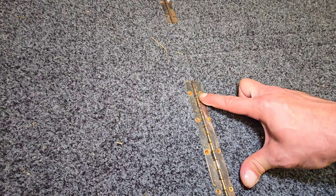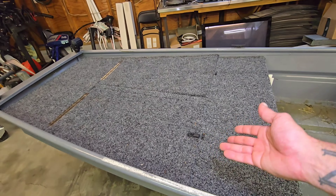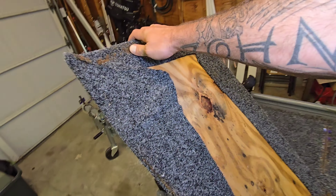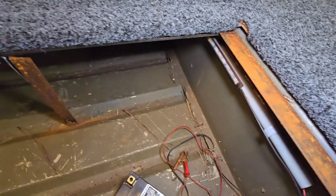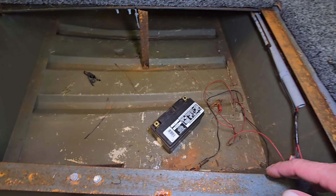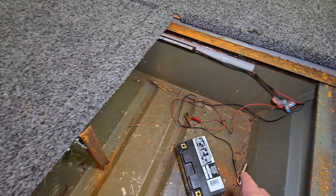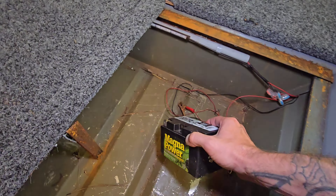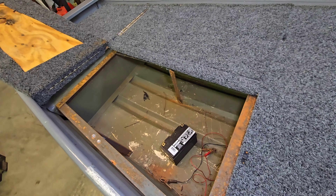Somebody used wood in here with steel hinges and steel screws - all no-nos. Wooden carpet, not up my alley. They did get a little casting platform in here, but look at this subfloor framing - it's steel angle iron. Are you kidding me? They put steel angle in a 10-foot boat. It's just bolted together with nuts on the back. Whoever did this, I guarantee was an electrician because there's lots of conduit running in here, some LED lights, and a little lawnmower battery. I'm going to use that to power his LiveScope.